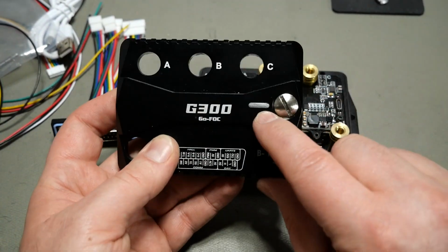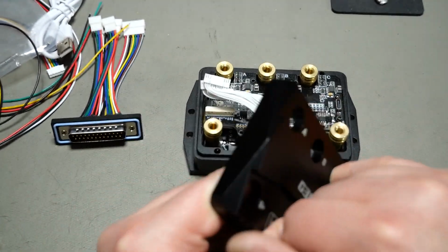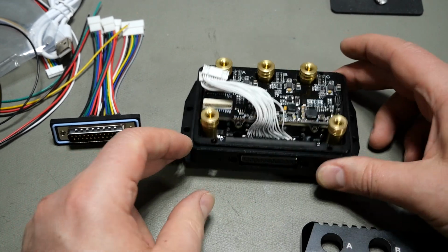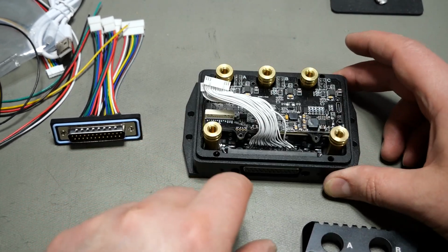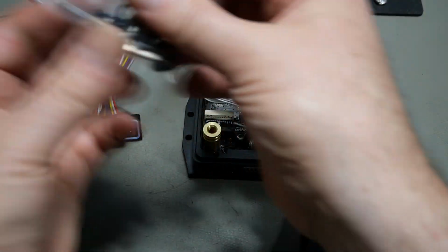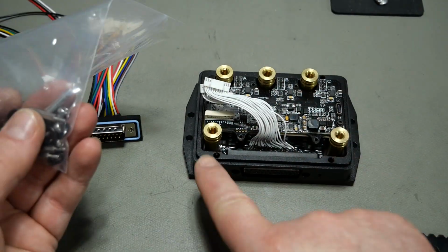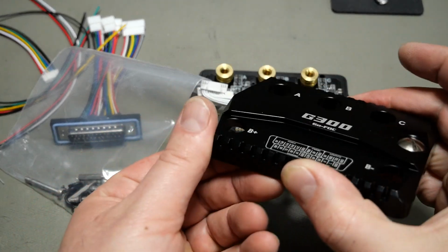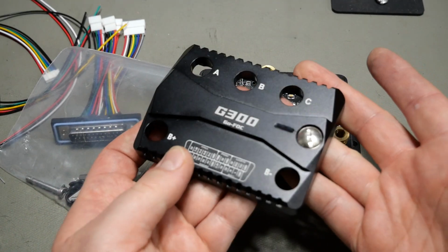So yeah, I like this little lid. I like the little screw connector. I like the little window. Even these holes right here where the studs come through, you can see that they have these 2 glands in them. And that's because, and I took them off, there is a bunch of O-rings that go in those glands. So 2 per stud. You get 2 seals from the aluminum lid to each one of these brass studs thanks to O-rings.